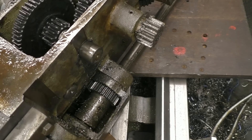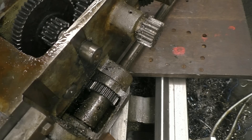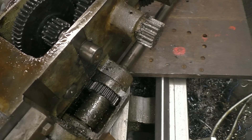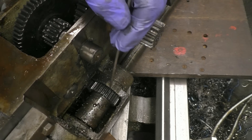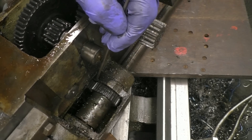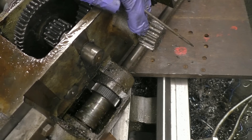Right, it's all in bits now. And what I've found is something quite simple really. There are just little bits of wear on the gears but nothing horrible — it's really solid in there. When I was turning that shaft — that's the feed shaft — it was locking up. Those two gears were locking up and there was a hard bit of swarf embedded in there, and that was enough to cause all this grief. That's working fine now, but it was going clunk clunk — you could feel it was locking up.